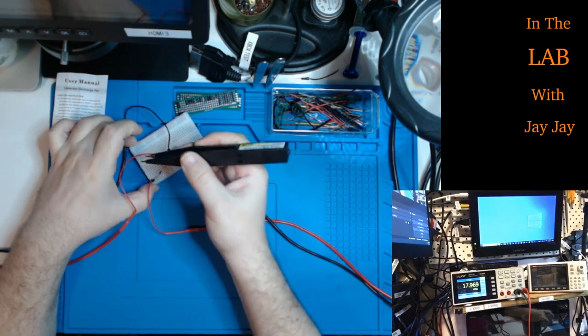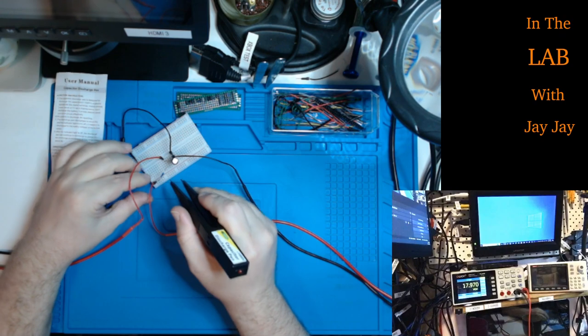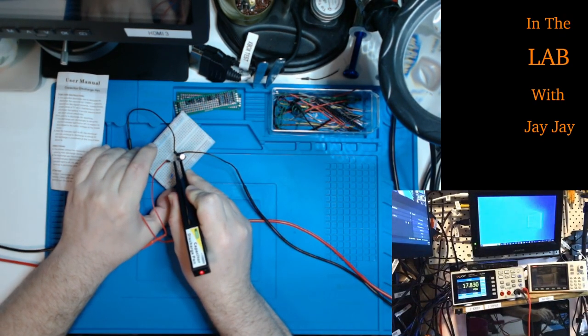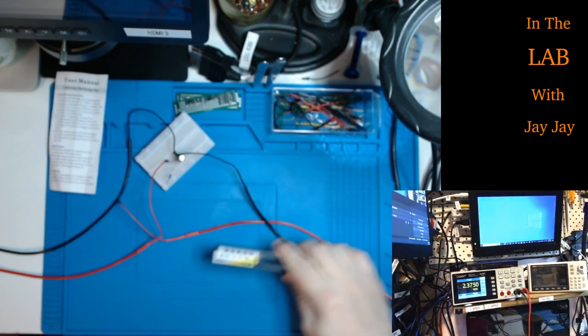Now, on the capacitor discharge meter, there's a red light, which will shine as the capacitor discharges. So what we're going to do now is keep our eye on the red light, and we're going to disconnect the power, and then there we go. You see the red light go up, and as it discharges, the red light goes down, down, down. And as you can see on the multimeter there, that's down to 2.4 volts.